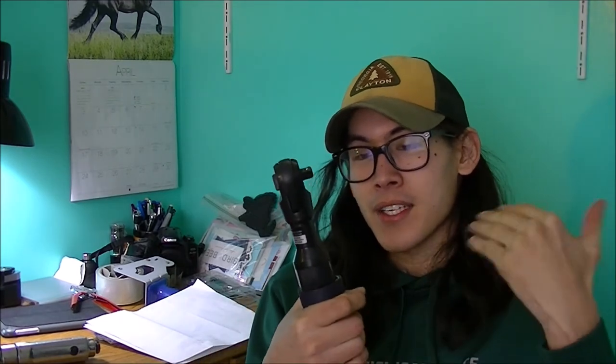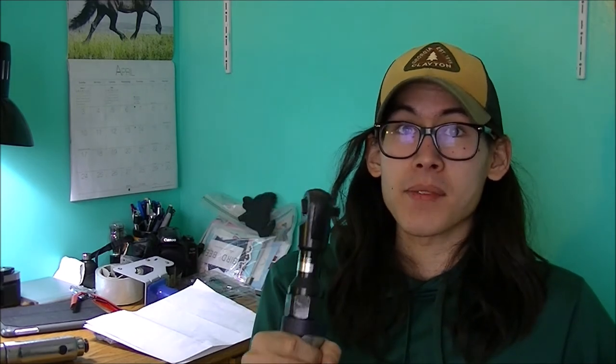I did try to open this up as well — that didn't work. There is no ratcheting mechanism, just want to be clear about that. This is a classic knuckle-breaker style: you put it on the fastener, and once it hits that stopping point, if you're not paying attention your hand goes flying. The Blue Point doesn't ratchet to stop either. I see people use these incorrectly — they think it's made to just pull fasteners off. No, this is made to help once the fastener is already broken loose.